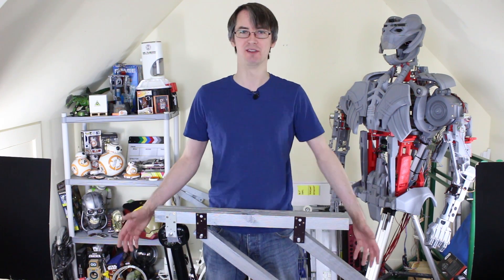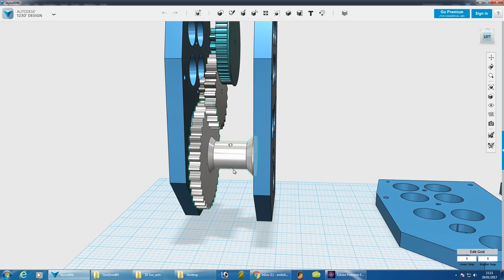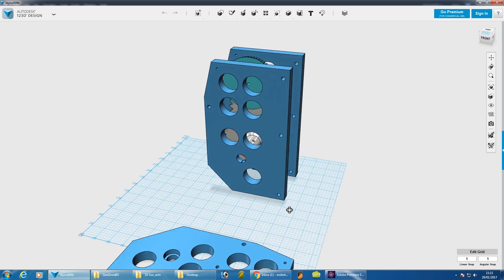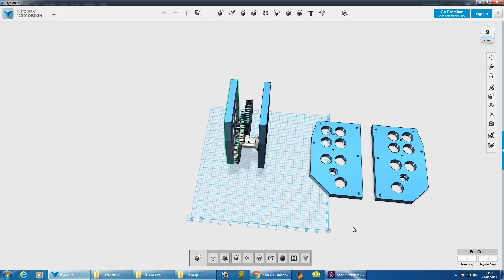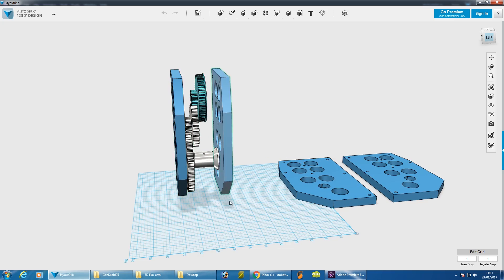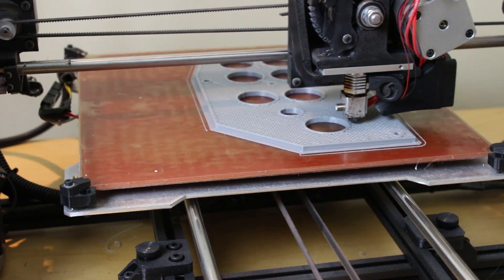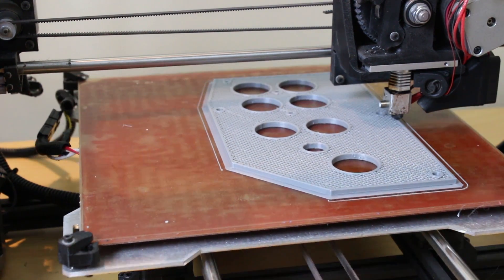My gearbox is going to be very similar to the rest of the build — three gears and a pulley gear that pulls a string. We only need to pull the leg shut; the spring will return it, so it's pretty simple. I've changed the shape of these plates slightly and laid them out flat for printing — those will be ABS, and the gears again will be taulman alloy as before. Here comes one of them printing now. The parts are about 14mm high so I'm hoping they won't warp — I've printed similar parts before and they were fine.